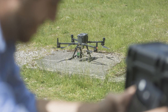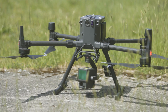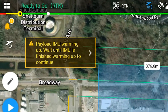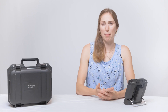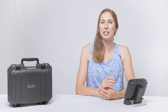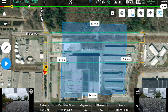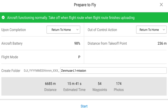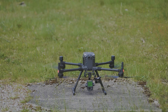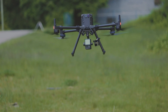Now that we've set up the DRTK, we can prepare the aircraft for flight. Be sure to run through your pre-flight checklist ensuring that the Matrice 300 is ready and safe for flight. The L1 requires a 5-minute warm-up period before executing the mission. The smart controller will notify you when the system is ready. We recommend that you enable the M300's beacon system in the manual flight app to increase visibility of the aircraft during the operation. When everything is ready, tap the play icon to start the mission. We want to ensure that the drone and RTK have adequate GPS coverage. Upload the mission and fly. During the mission, you should always keep an eye on the aircraft and monitor the power levels remaining on the drone and watch out for any hazards.